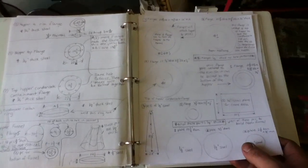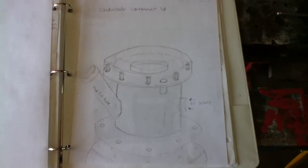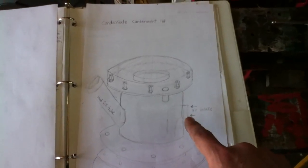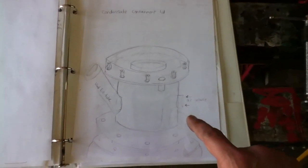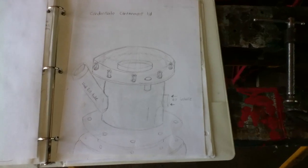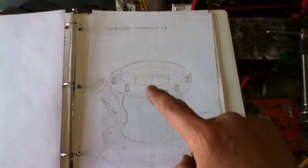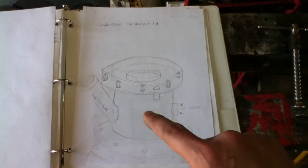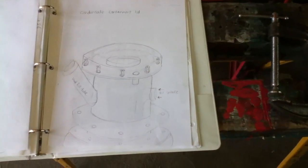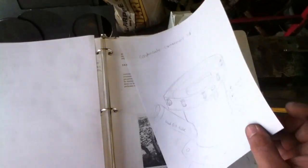Still kicking around using high temperature concrete on the outside of that funnel too. This is a preview of what my condensate containment lid is going to look like — it'll have an air intake similar to how Flash set his up. Every fitting coming in and going out of my gasifier I'm going to oversize, because I can always reduce it down but I can never increase it. I'm kicking around the idea of a side load, and thinking about insulating everything here so condensation doesn't form on the walls but instead forms at the top where it's exposed to cooler temperature.